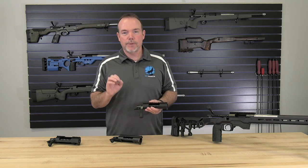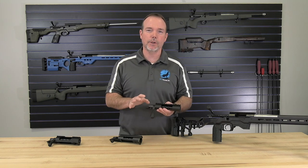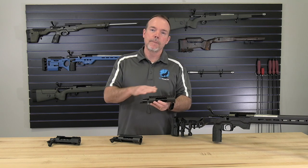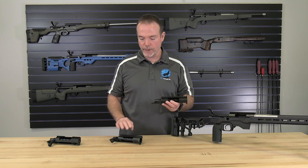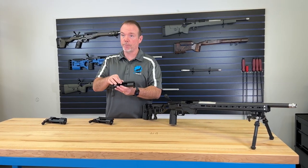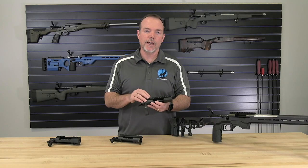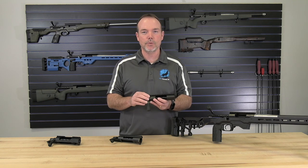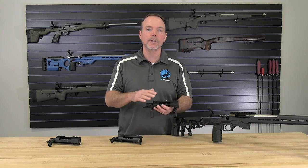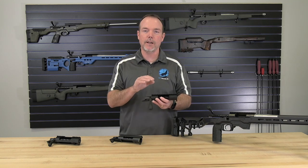Another thing to consider when purchasing the Tactical Elite action is fewer working parts. One of the reasons I choose to go with this on my tactical rifle is simply because we're subtracting the number of working parts on the receiver itself. The rail is built into the receiver, so there's one less part machined and added — the two pins and four screws. When you add that together, you're removing seven working parts from the receiver, and less is better. You've got fewer screws to potentially loosen up, eliminating a lot of additional parts and making it essentially one piece.